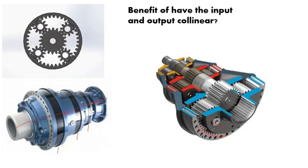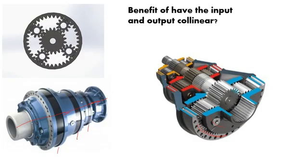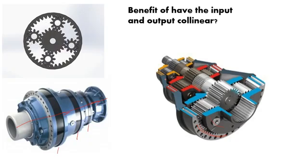So what you can do is engage the different gear sets by either locking something up, and causing a particular gear set to drop out of the system, or freeing something up and causing it to actually engage the system. That's how you can have an entire gear system and cause it to go into reverse, or one of the methods. There's several methods of causing it to go into reverse, or go forward, or just attain a different type of speed. So depending on what you want to lock up, or what you want to hold as stationary or reactionary, to use more technical terms, helps dictate how you're actually going to operate your mover. So thinking of this as a tank or as a car or some other big vehicle, that would be the application, to your question. Now, I'm going to break this up into two videos.